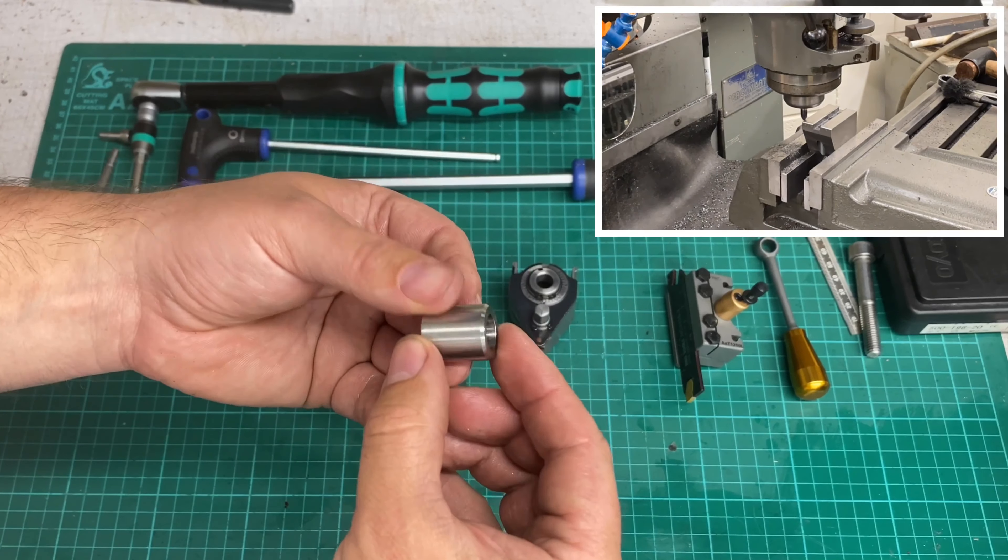These multifix tool posts are designed so that you can use any one of these three hold positions and get more flexibility in terms of the rotational positions on the tool post, because it has this detent mechanism in here - which is quite handy because it means you can more easily align the tool post to where you want to use it. But it is a bit restrictive in terms of the approach angle of the tool. I'm only ever going to be using this tool post with a tool at 90 degrees to the spindle axis, I think - but that's my intention at the moment.